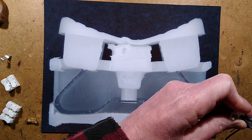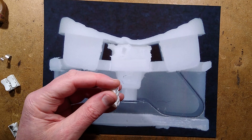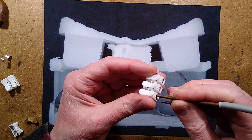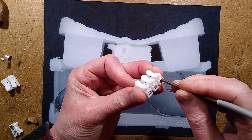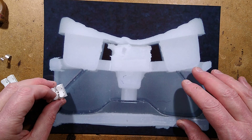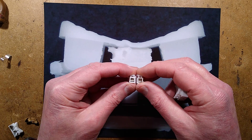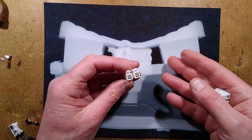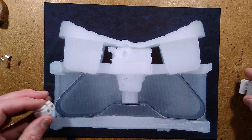The listings for these rate them at 10 amps, so hopefully people will get an idea that they're not really rated for ring final circuits. They also say things like 'suitable for 2.5mm cable.' Testing it — it has pushed in, and it seems to lock fairly well. That's promising in a way, but not suitable for high current. I'd rate these only for lighting type stuff, maybe one amp or so — the sort of thing you'd find inside cheap fluorescent lights. Some studio lights I got from CPC did originally come with these, but they've since changed to a Wago-style connector.